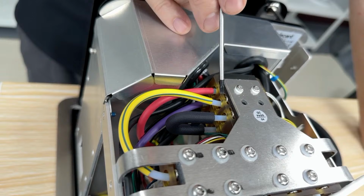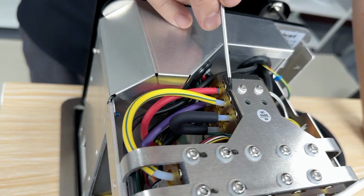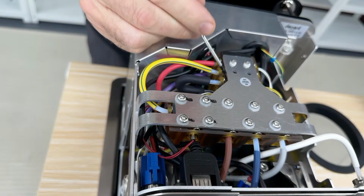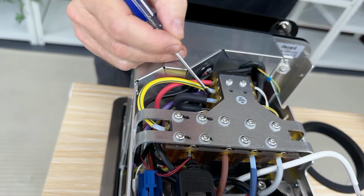That's why a metal tube going into a piece of metal with some solder cracks, because there's 3 metals there and they're all heating and cooling at different rates. With this, this tube is just laying there slack, and you can see I can even move it a bit. You can see this here vibrating with me. And these things, despite thermal cycling on off, they don't leak, they don't fail.